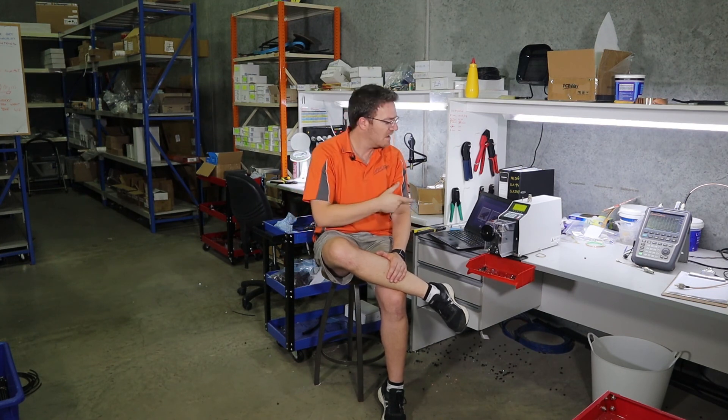So we try to ask — if we feel that somebody selected something and it looks different than normal, we do ask: do you want this one or that one? So there you go. Three types of connectors for the SMA: it's the male conventional or female conventional, or the reverse polarities that you need to worry about, or on the female bodies you need to look at bulkhead or non-bulkhead. Who would have thought such a simple connector and you can spend this much time talking about it.